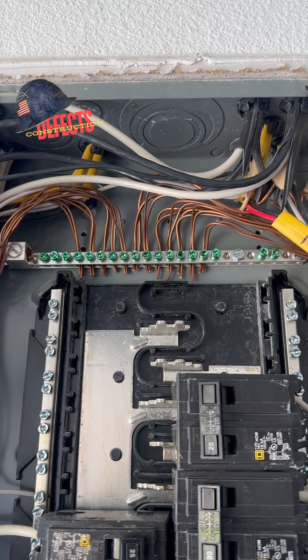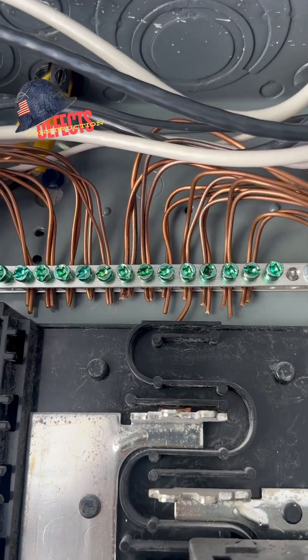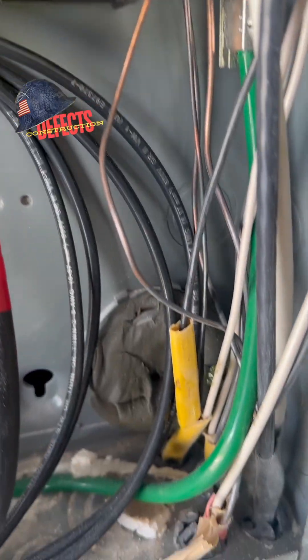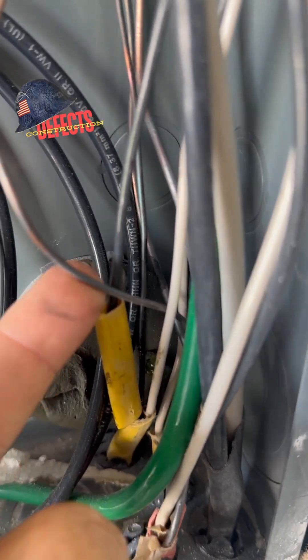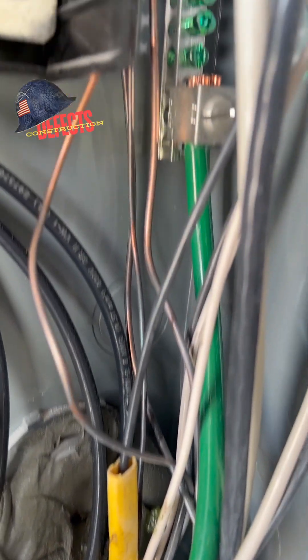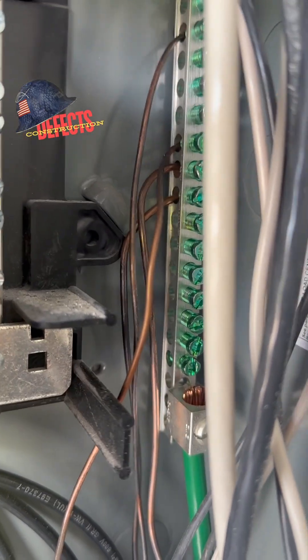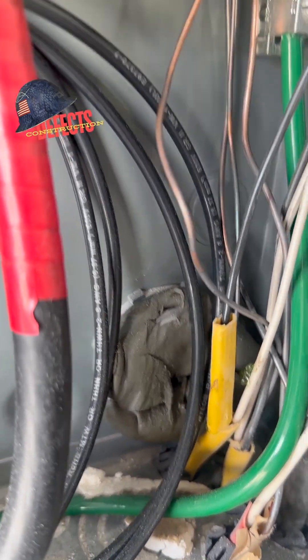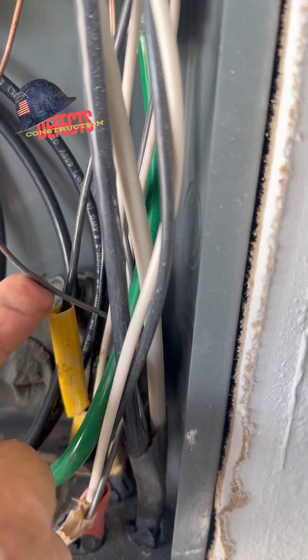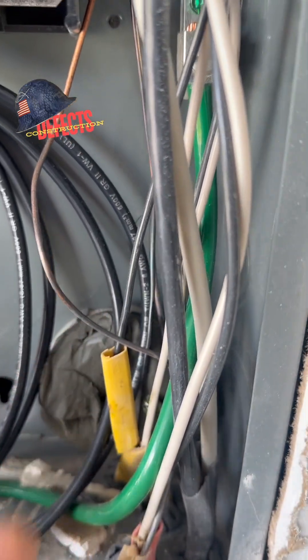Here's the copper wiring in a bus bar — these are your ground wires. As you move down here, you can see the copper wire is no longer copper-colored; there's a nice stringy black or bluish-black discoloration. There are multiple possible causes for this: Chinese drywall, lightning strikes, or keeping your pool chemicals too close to the pool panel.